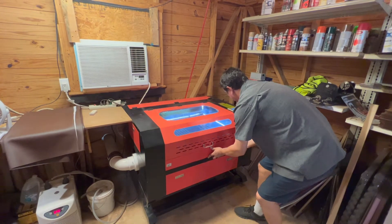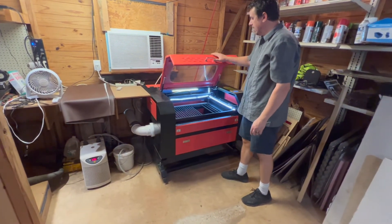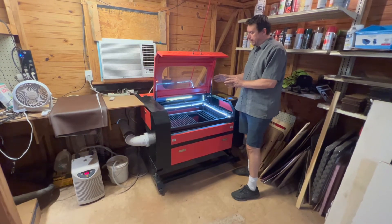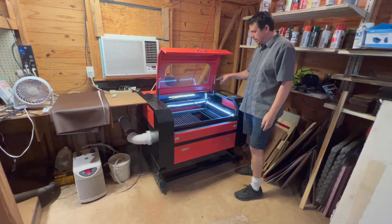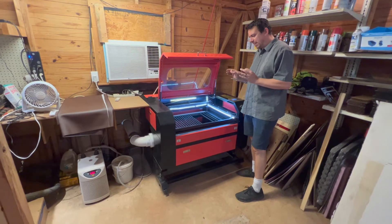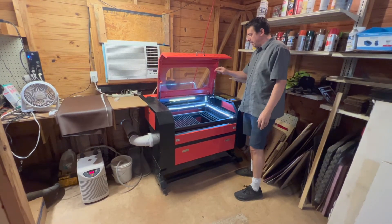It's got a lot of plastic and a lot of play because of that. Imagine if you mess with them a lot — they would fail on you. The biggest issue I had with this machine is repeatability, precision repeatability. I could run probably 10 cutting boards on this machine, and then due to the way these belts are made, eventually you can only tighten them so much and they'll start to inherently slip on you just a tiny bit. You'd have to reposition your jig and do your cutting board based on your new point of reference.